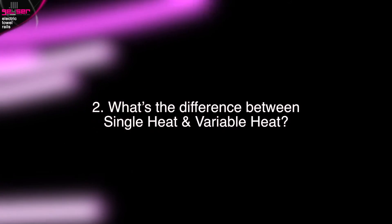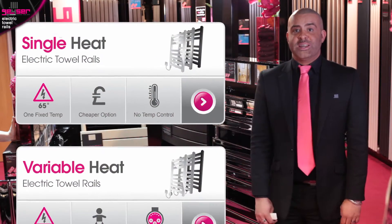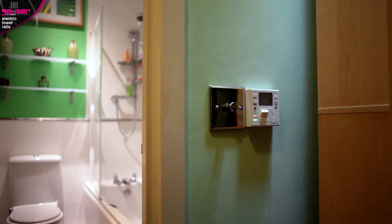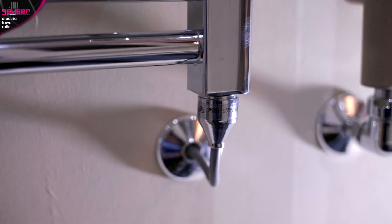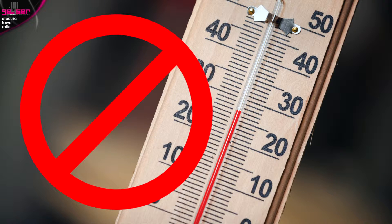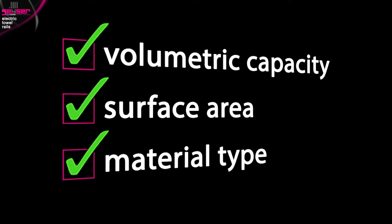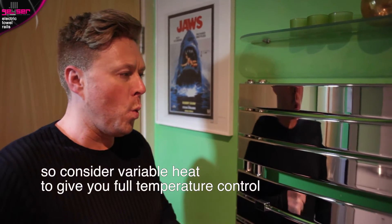What's the difference between single heat and variable heat? Let's break this down. Single heat electric towel rails are the cheaper option of the two. They are operable only from the switch located on the fuse spur outside the bathroom — there's no power button on the element itself. You have no control of the temperature; these will regulate at a fixed internal operating temperature of approximately 65 degrees. However, this doesn't mean the surface temperature will be 65 degrees. Various factors such as the volumetric capacity, surface area and material type will determine the surface temperature. Chrome rails insulate heat so can get quite hot to the touch.